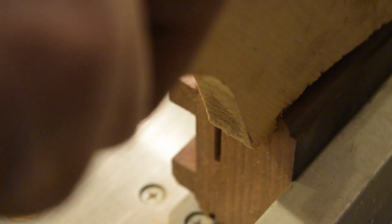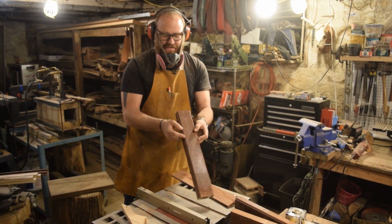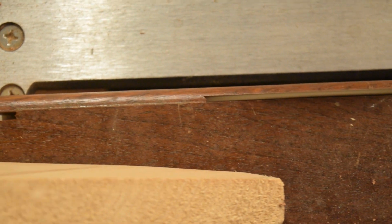These were mahogany railings, and I had to trim off the kind of decorative side first that held on. Now I got to trim off the other side. Now there's these bull noses, but the space right between them is 2.5 inches, so I have to rip the bull noses off both sides. It should leave me basically the exact width that I need for my pieces.